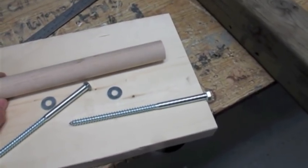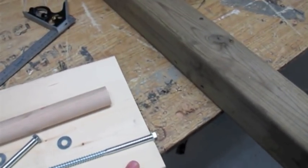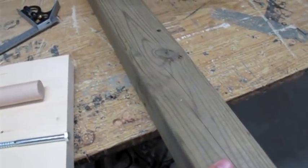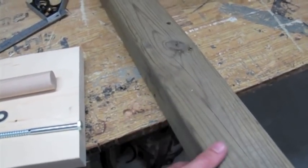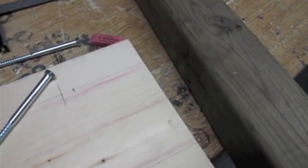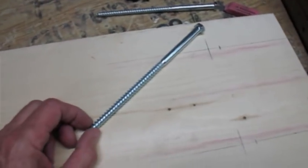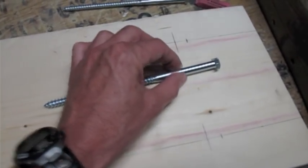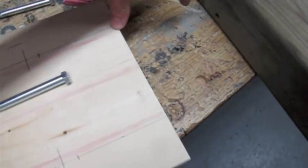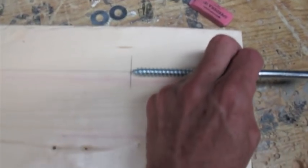We're going to use an inch and a quarter dowel, drill some holes into the post, and join it on here — and I'll show you how strong it can be once we're done. Note: this is pressure treated wood and we are not going to use this in an actual bed; this is just for demonstration purposes. So I've marked off this 2x10 that we're going to attach to the 4x4 post — actual dimension 3.5 inch by 3.5 inch. We've got an 8-inch lag bolt here, 3/8 of an inch diameter. The 3.5 inches the post takes up leaves us 4.5 inches, and that's where the tip of the bolt will come to, right to that 4.5-inch mark.